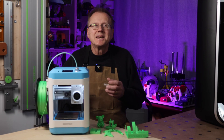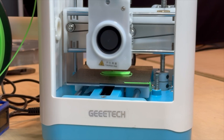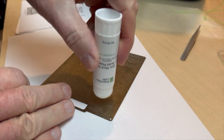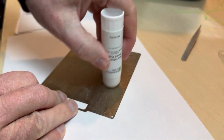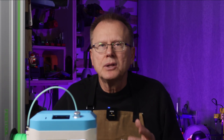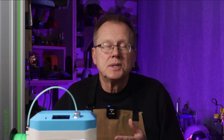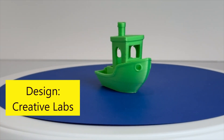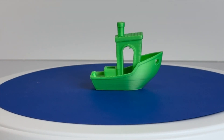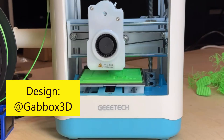For my first part, I decided to use GTech's pre-sliced Benchy that was on their micro SD card. I started the print, but soon after it released from the build plate, so I decided to add some glue using a glue stick. The glue helped with adhesion, and I think it's important that GTech include a glue stick with the printer so beginners don't get frustrated with their first experience. The quality of the Benchy was reasonable — the seams were quite noticeable and there was filament hanging down from the top of the doors and windows, but overall the print looked pretty good.